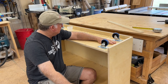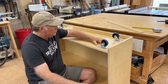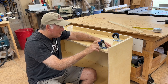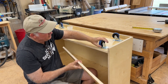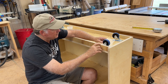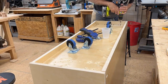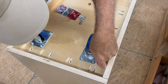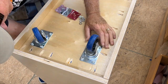I have the pickleball paddle rack upside down to install the wheels. We wanted to have a front lip that would be 2 inches from the ground so pickleballs could not go underneath it. We're going to put a little lip in here, cut to about an inch and a half wide, with approximately 2 inches of clearance above the ground. We drill the holes to attach our casters with bolts, then enter the bolts from the top side through and bolt them in. And just like that, we've got wheels.